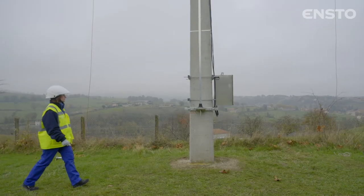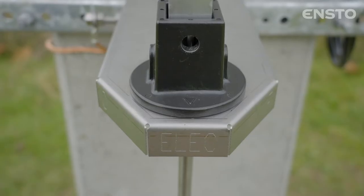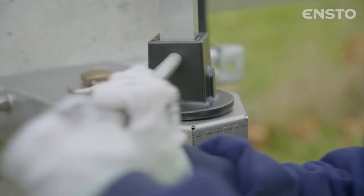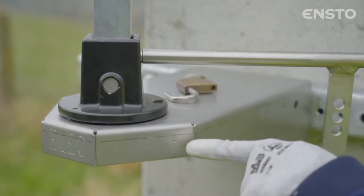During operation, the device can be controlled manually or electrically. The manual backup control and its lever can be padlocked in one of the three positions. An intermediate position which permits electrical operations, and two end positions that prevent them: padlocked open, padlocked closed.